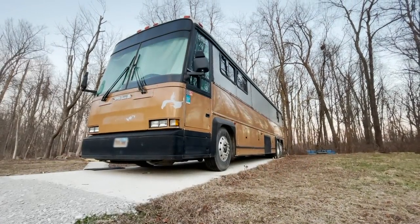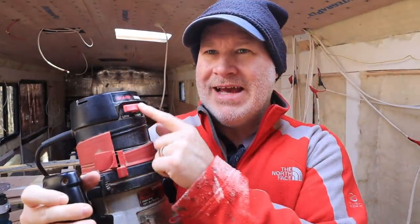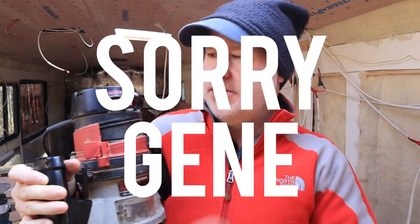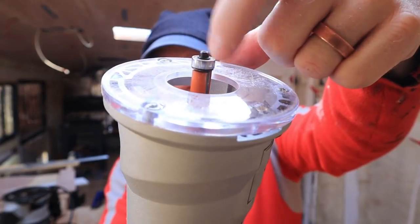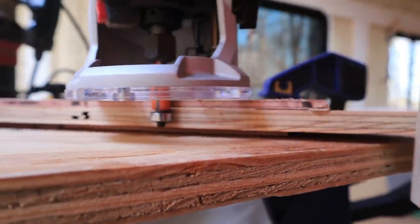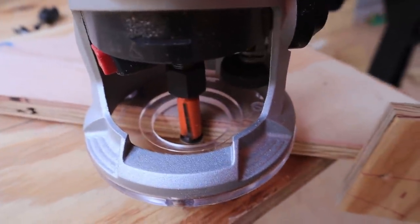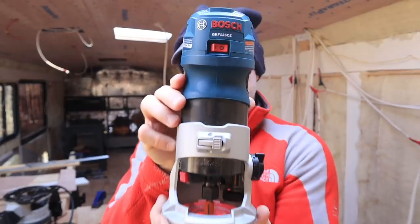We went to the hardware store and I got some new bits for the router — my cousin's router was probably made about the same time I was. It's heavy, bulky, and the plastic's old. Sorry Jean, a little plastic part broke on me. After a day of experimenting, I figured out I had the wrong kind of bits. We had to get a router bit with a ball bearing at the bottom so that when I cut into our new wood panel for the walls, it could follow the track of the new jig template and make a nice clean cut.